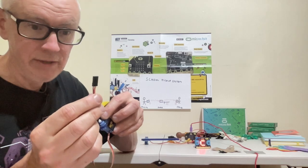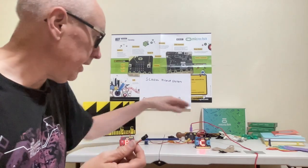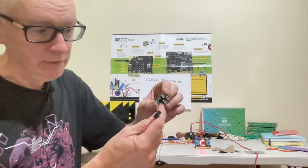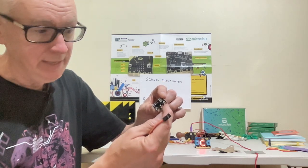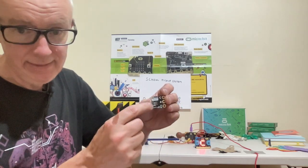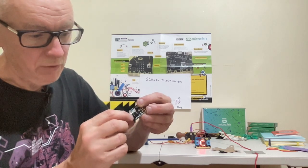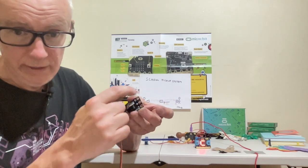It's got 3 wires, a brown, a sort of reddy colour, and then an orange. And so I use these little clips that I just bought off the internet. I think these are Monk Makes ones that have 3 rings on them that you can put the crocodile clips on. So you have the minus, which goes onto the ground of the microbit, the plus, which goes on 3-volt of the microbit, and then the C, which is the control signal that goes on pin P1. And then it has a little series of 3 pins there, and you put the servo plug in, so you can see there's these tiny little bits of gold that shine through the plug, so they're facing up, and that's the right way around. And then you can basically clip the crocodile clips onto there.